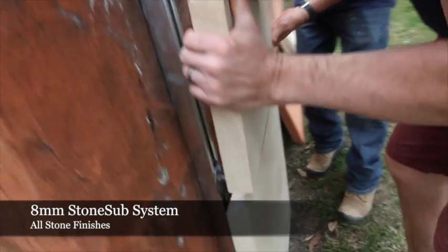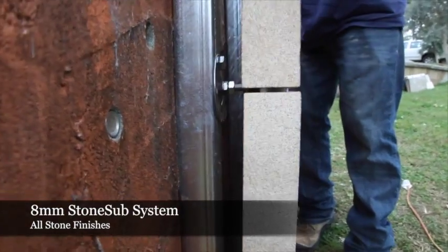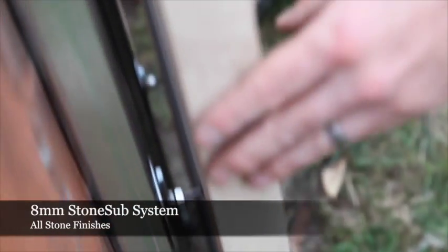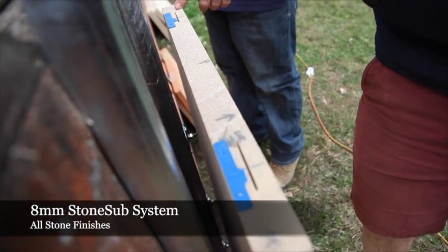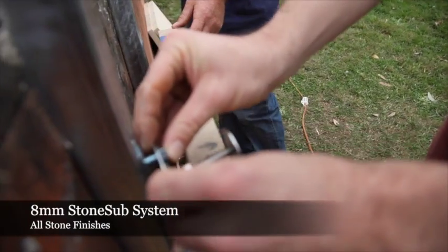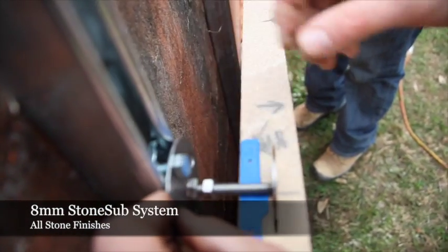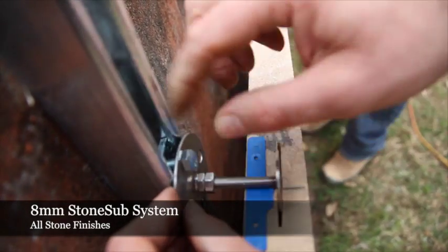All the installer has to do is line up the cut stone with the clip, put it down plumb, and install that panel down over the shaft. We've placed in a 1.5mm spacer. We're now going to get the adjustable clip and apply that to create the stone sub system by installing it onto the channel. We lock in our channel nut, pull our clip down, bring it forward, and at this stage tighten up the nut.